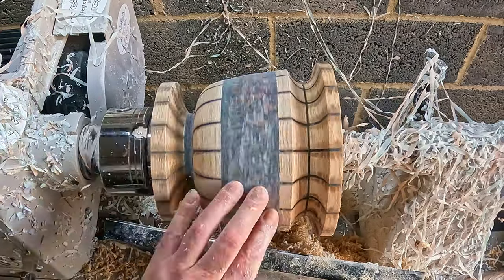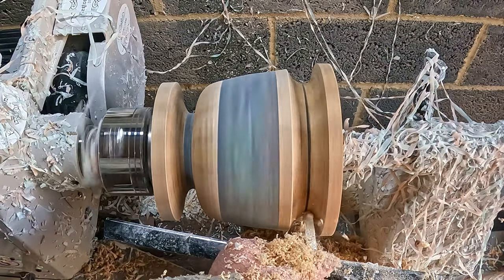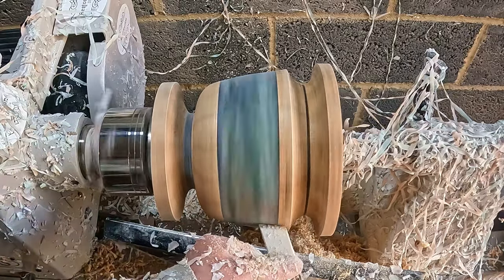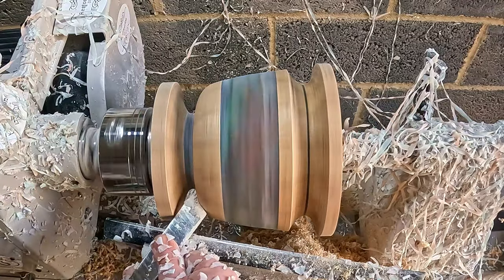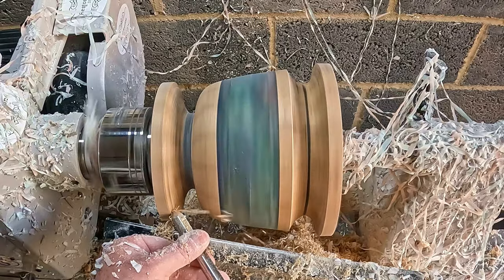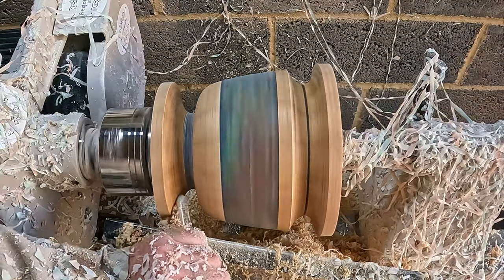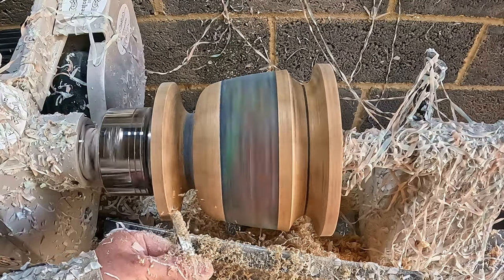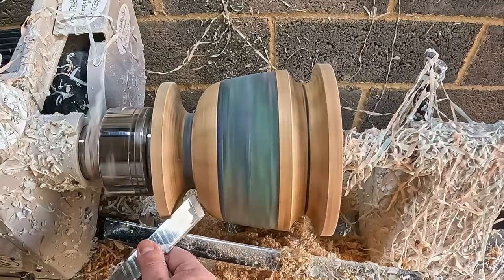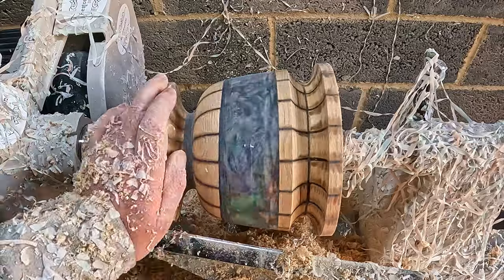After tidying up the rim edge I fine-tuned the curves of the upper cutout using the mid-sized carbide, keeping the cutting edge moving to avoid tool marks. Then it was on to the skew to blend the lower cutout into the midsection, and some work on the base thinning it down to match the rim. I used the bowl gouge to gently ease away excess material, shear scraping to get close to the finished surface, then the mid-sized carbide for blending and fairing it all together. A final pass with the skew and the outside was done; I sanded with 80 grit to check for tool marks.